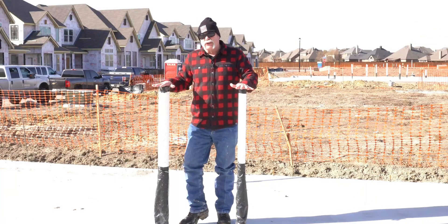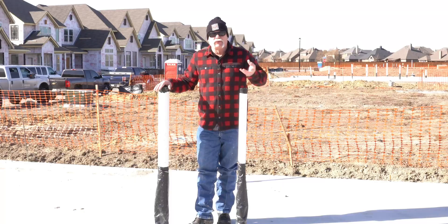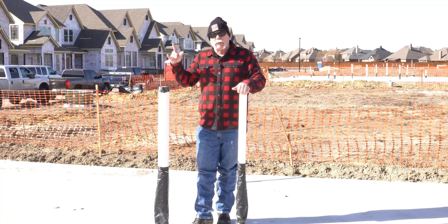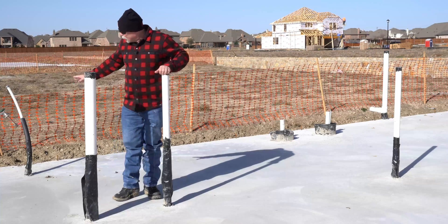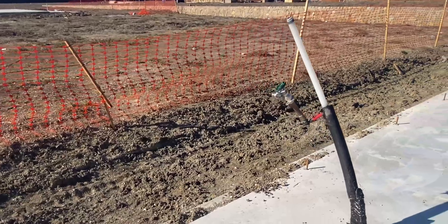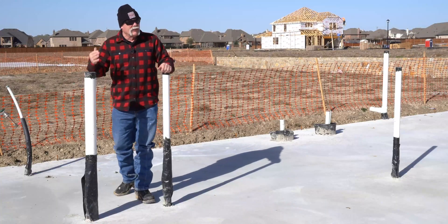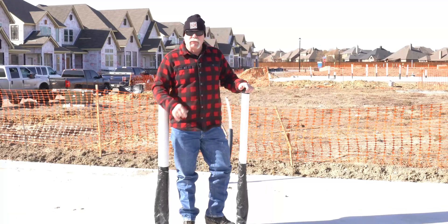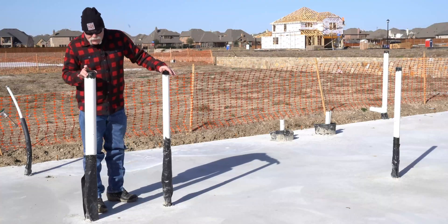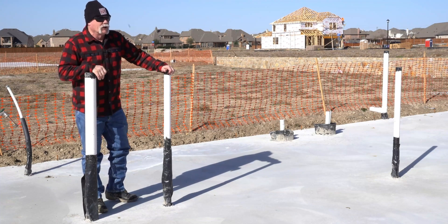Remember the two lines I told you were probably catching upstairs? This one is probably catching a washing machine — most homeowners prefer to have their washer and dryer downstairs, so this would catch the drain box. This is probably going upstairs to catch additional plumbing. We've got the water line behind us, which makes sense with the garage right there. You build a platform, put your water heater right out there. Hopefully it's far enough over that it's still on the wall.